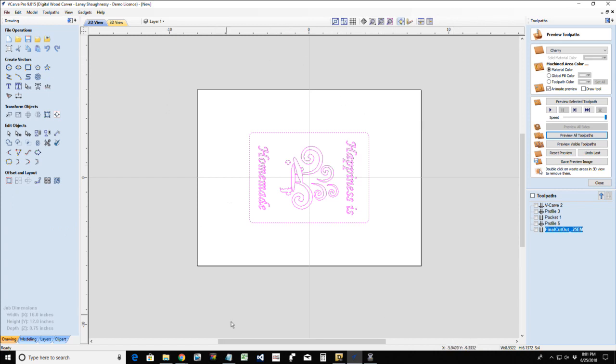Because I'm using the same board, instead of creating a separate V-carve program, I'm using kind of the same layout. But as long as I'm starting from the center, it doesn't matter if I'm starting from the center of this 8x6 area or the center of this 16x12 area, right? So when I create this tool path, it's going to be based on this small area here. I would have my 8x6 board clamped on my table, orientated along the x-axis the way it is running here, and I would be doing my inlay.